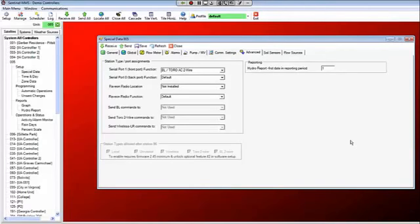If you wanted to verify this and you're in the software and you've established communication to your controller, you're going to go into that particular controller, you're going to go to special data, and then you're going to go to the advanced tab in special data. So you click on the tab and it brings it to the forefront right there. The front port, after you receive it, should say that it is set to BL/Toro AC 2-wire. If for any reason it comes back and it says default or it says any other sort of function, it is not going to communicate to that 2-wire board.